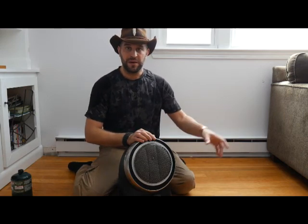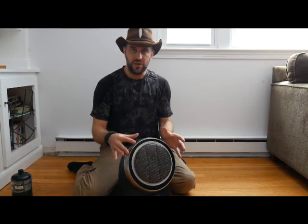Now let's talk safety. Carbon monoxide — first up. Because it's a catalytic heater, almost zero, virtually zero carbon monoxide is given off, so you don't have to worry about that. As a matter of fact, if there's a blue flame on a propane appliance, there's also virtually zero carbon monoxide. The one you have to worry about is when there's an orange flame — that means it's not totally combusting the fuel and carbon monoxide is being created. But with this, you don't have to worry about it. You should have a battery-powered carbon monoxide detector for emergencies anyway and have it nearby, but this should not be giving any off if it's working properly.